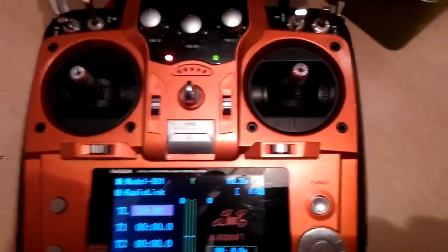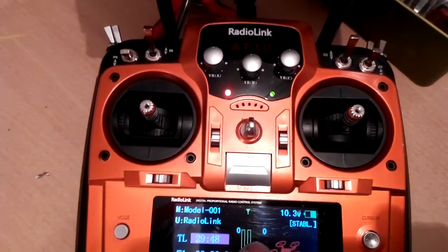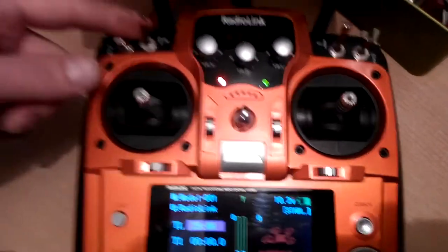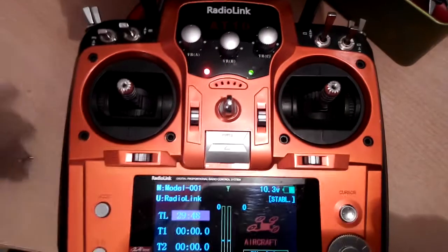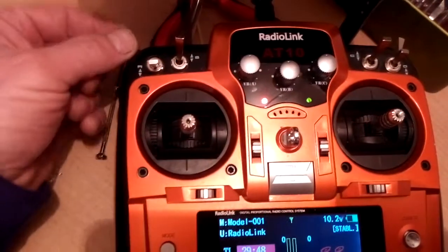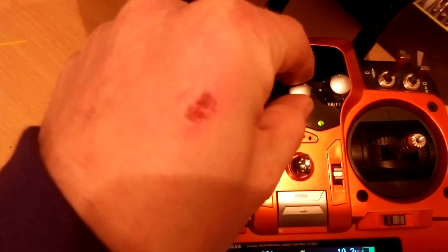The auto-tune channel is set on channel 9 — I take the servo cable from channel 9 on the receiver and plug it into channel 7 on the APM board input. That operates channel 7, and I have it set in Mission Planner for auto-tune. The other switches handle the gimbal: one channel for gimbal modes set at specific percentages, sliders for up-down pitch control, and one for yaw control on the camera when airborne.